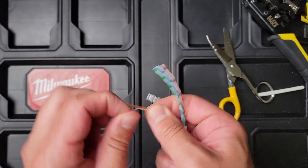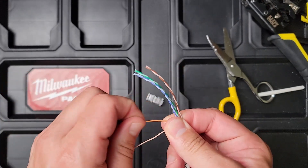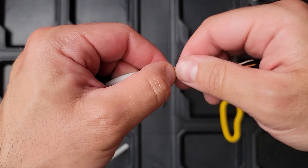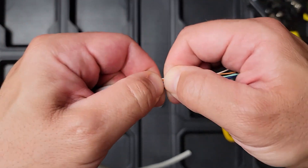So let's start by stripping the cable and breaking it apart. The 568B order is: orange-white, orange, green-white, blue, blue-white, green, brown-white, brown. I can untwist them pretty quickly with my fingers. Some people use the snips to straighten it out. The Superior Essex cable is pretty nice — you can undo it quickly. Get it nice and trimmed up.